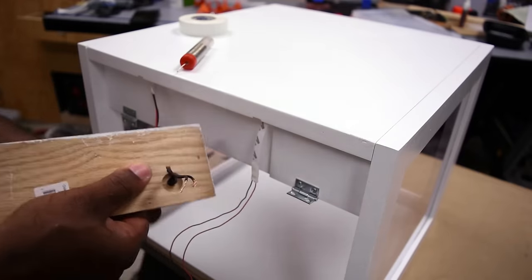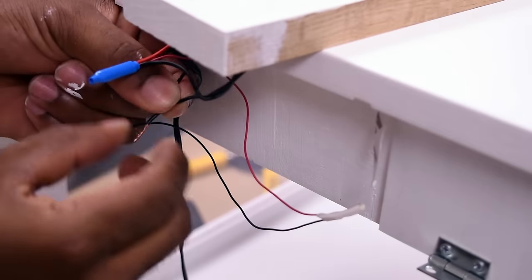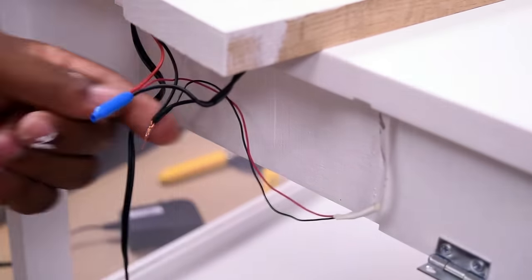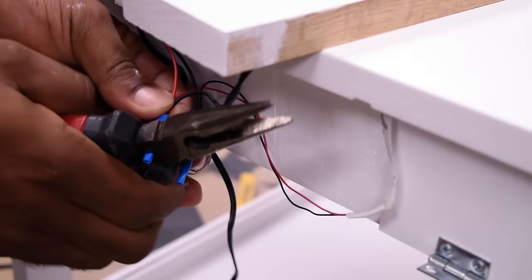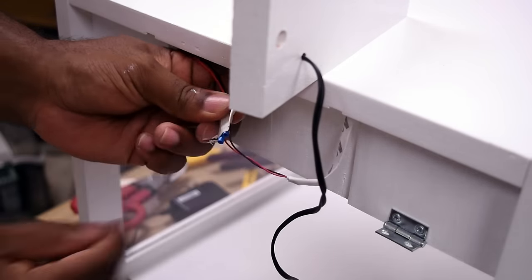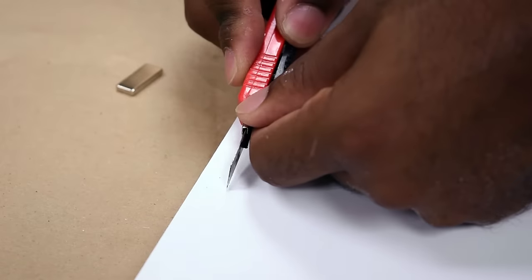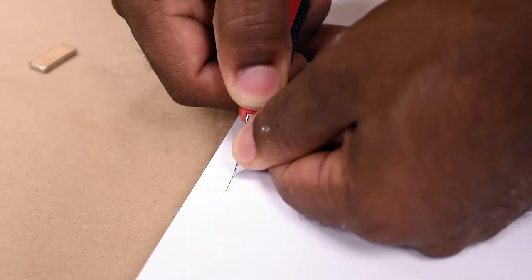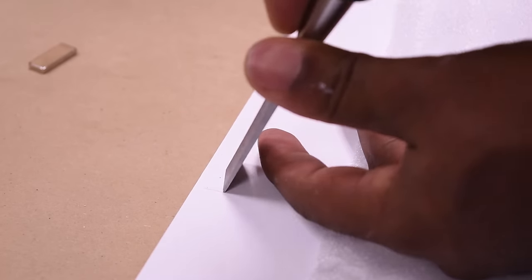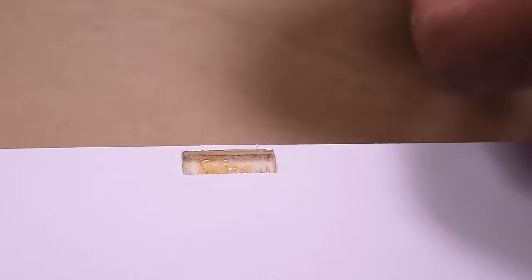I made a piece of wood to represent a cover, passed the wire through it, tied a knot, then made up my connections. There are multiple ways to splice wire — in this case I'm using B-connectors, which have teeth inside that bite into the wire when you smash them. Using the screw as a reference, the magnet should be dead center of the door at the bottom. The magnet will be recessed in this location, and you have to be careful when notching out this section, otherwise you'll tear off the edge. I used Gorilla Glue to install the magnet.